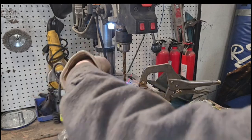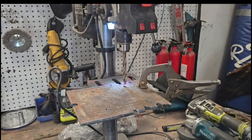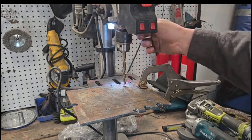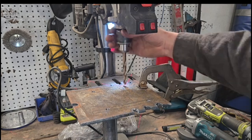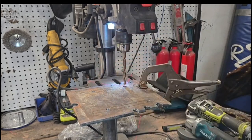I'll probably need to upgrade the belt drive too. In addition, I'm also planning — not in this video — on taking this thing apart and boring out the spot for the spindle bearing, so I can have a heavier-duty bearing that's designed to take side load. But that's in a later video; for now I'm just gonna get the thing functioning.